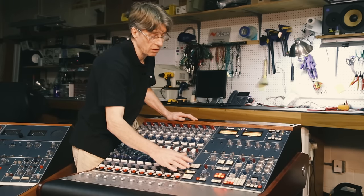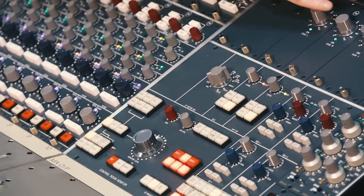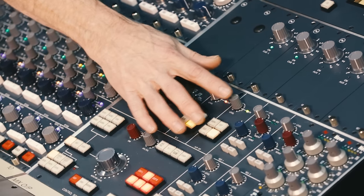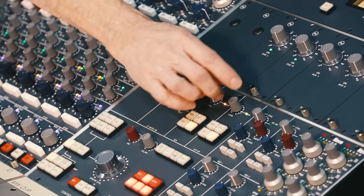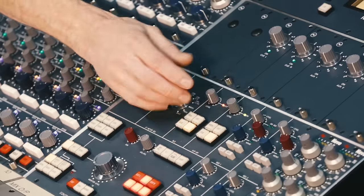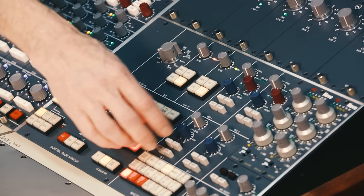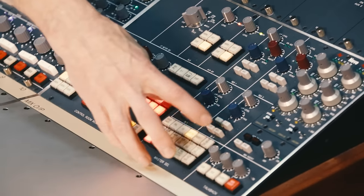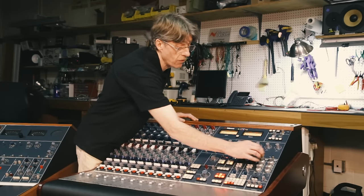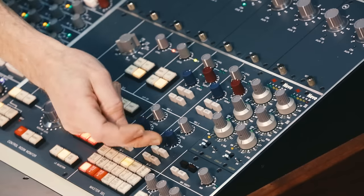We have a very comprehensive solo system. Over here we've got the monitor section, which can be stereo or a 5.1 listening monitor section. We've got meter selection for the two main meters, an SLS system which can double up as a second cue send, a headphone/loudspeaker selector with a level control, two stereo reverb returns with width control and monoing, two direct inputs onto the buses, a master selection for all master functionality, and a very comprehensive talkback system. We also have two 500 slots, which can be either patchable or put across the main mix bus.